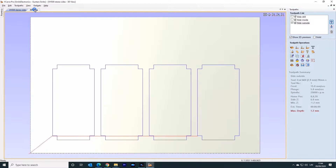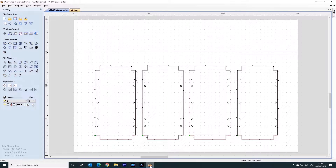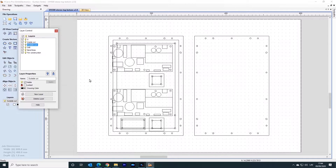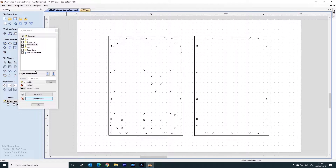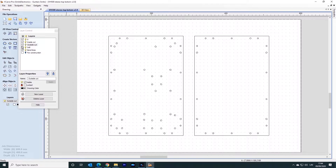The first components to be produced are the enclosure side shapes — a non-standard design with high probability to make a mistake, so we are making some spare ones. The lower part of the housing is where electronics boards will be fastened. For modeling purposes I made critical component drawings with precise mounting holes. By grouping objects in blocks we can estimate distance to edges, critical dimensions, and optimize assembling. The holes, cuts, external and internal features are grouped by layers, simplifying router cut tool programming and reducing potential mistakes.